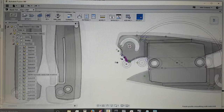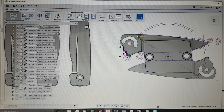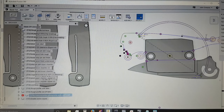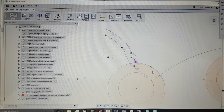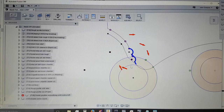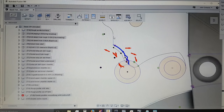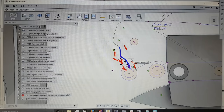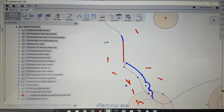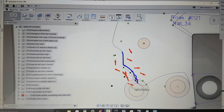I hid the fixture and I'm going to hide this blade. I love all the little light bulbs in here that let you easily hide stuff. He questioned: when you are choosing a toolpath, I want to start here and go here, and you just start clicking. It works, but it's selecting many different pieces of the arc — not selecting them all concurrently. And all those arrows have to be pointing in the right direction. Now they're pointing in both directions, left and right. You can change some of them, but some of them won't change. That's just not good, because if we post it now, it's going to take 10 different toolpaths to do this — one little cut, go up, another little cut, go up — and it's stupid.